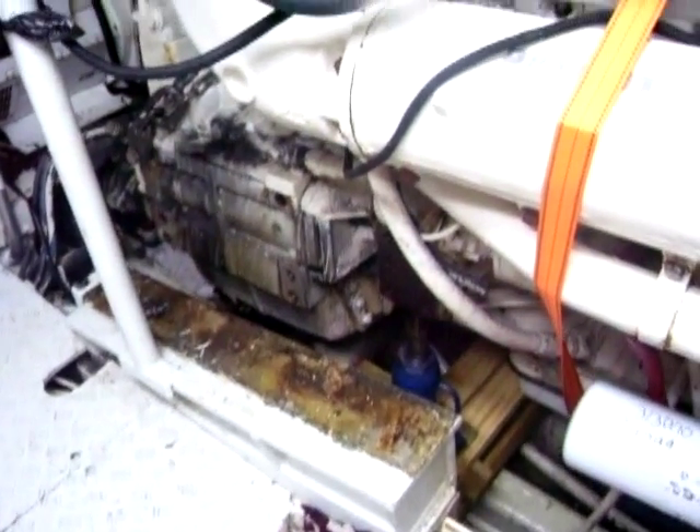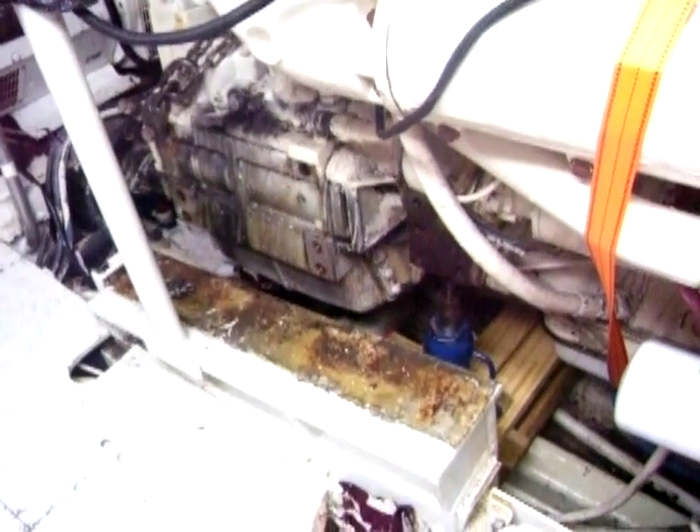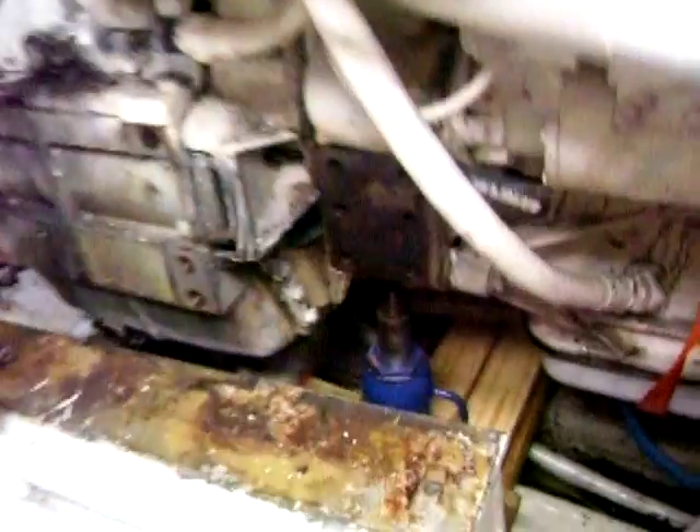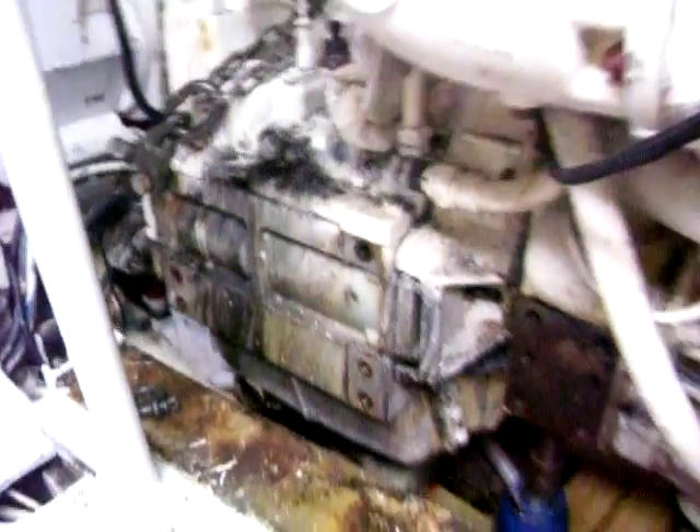This is kind of part two on this video. We've removed the side plates from the transmission, and we've got the jacks holding the back of the engine up. You can get a little better view of what we had to do to brace up across the bottom of the fiberglass hull. Our transmission weighs, I believe, 800 to 1,000 pounds. It's going to be lifted with this rig. We've got the beam, half of it on the engine, half of it back here on this shelf that attaches to a bulkhead. And you can see down here — that is braced against the top of the generator.